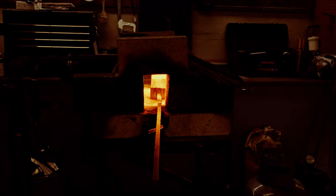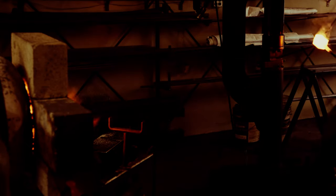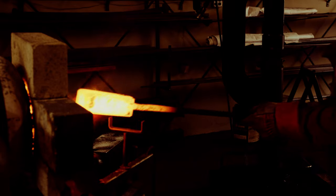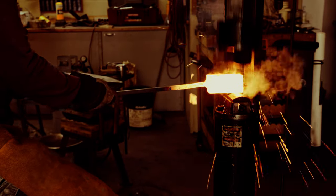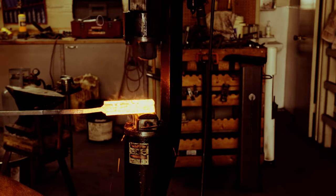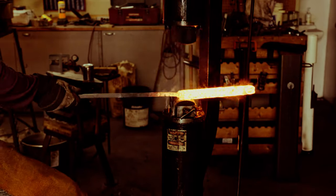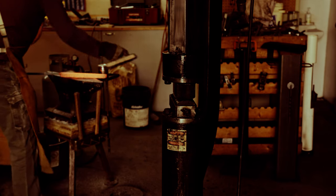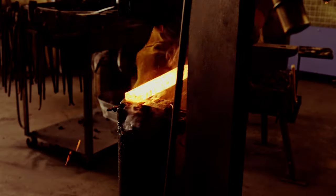Now I am off to another round of forge welding and then drawing out the welded billet again. Although quite loud, it can also be quite meditative. You may notice that the power hammer has split dies. On one side are flat dies, and the side closer to the camera has drawing dies. I heavily rely on the drawing dies to quickly elongate the billet. To be able to cut and stack the billet again, the bar needs to be of even thickness and width, and you can see me do some fine tuning here.